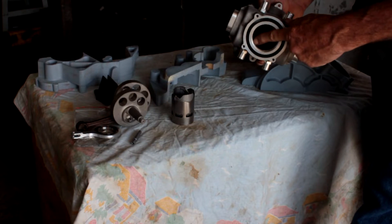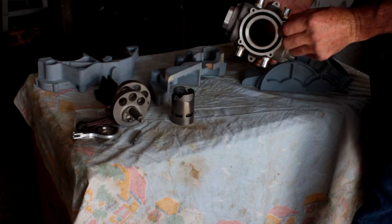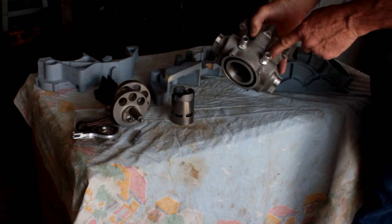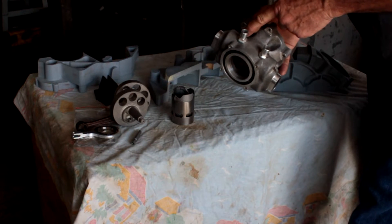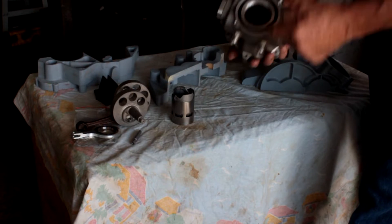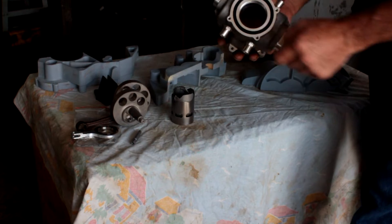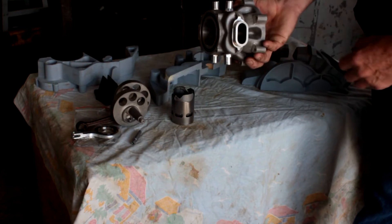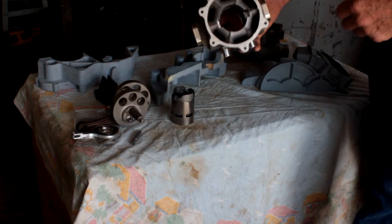The head screws in and comes up against this little land here. This is just a cover to hold the water. They're actually core print holes - I've got to have them for the casting anyway, so I decided I'll just have four large water inlets because it's going to be important to keep that cool. Lots of water flowing through. There's one exhaust there, another exhaust there, and nice swooping transfers.